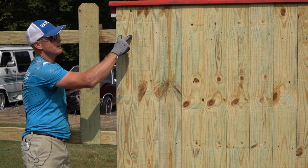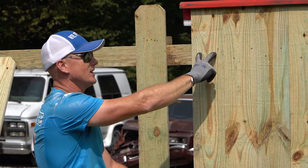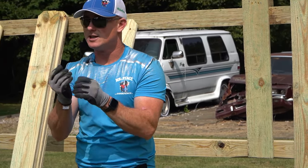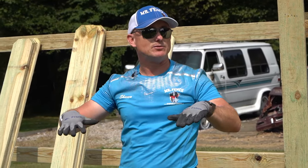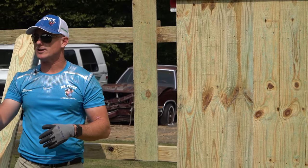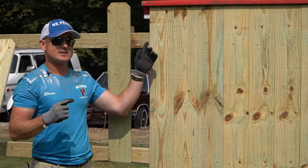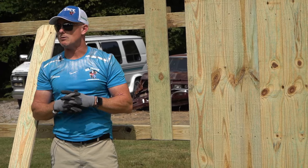The next reason is I'm grabbing a bigger chunk of the picket and holding it against the rail, spread out. If I had two nails right in the middle, I'm unsupported from there up 8.5 inches. The warping homeowners complain about is at the top. Think of it like this: if you strap a bundle of pickets with a 1.5-inch banding strap, the pickets curl up under compression. But a 4-inch strap lays them flat because you're grabbing a bigger chunk. I'm grabbing at least a 2-inch chunk of the picket — 800 times more surface area attached to that 2x4. So two reasons: it looks good to the eye, and I grab a bigger chunk of the picket.